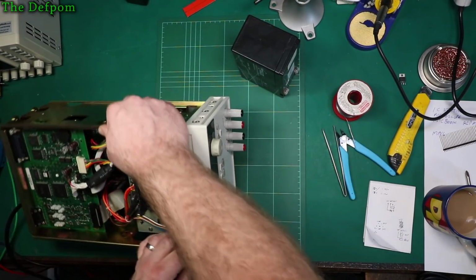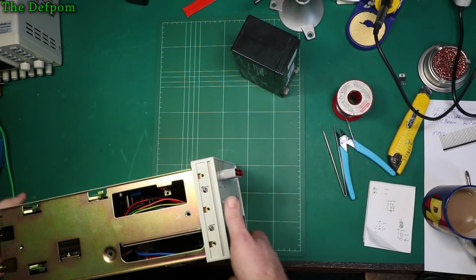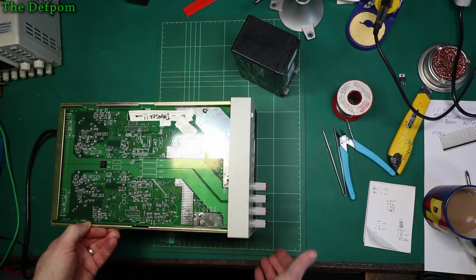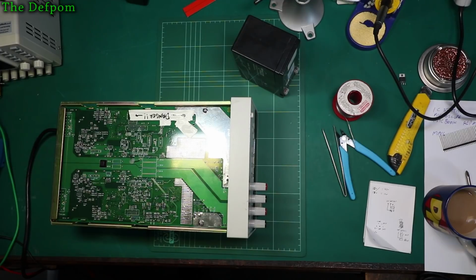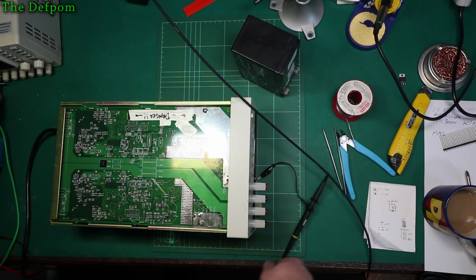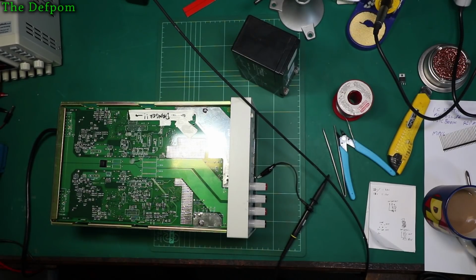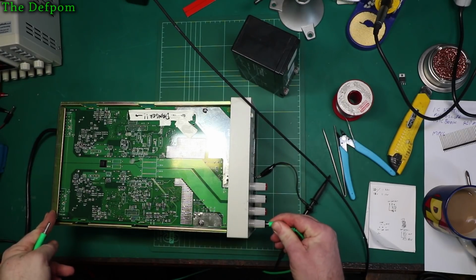Maybe that 5 volt threshold isn't suitable. Maybe it's still pulling it down, effectively being 5 volts. Then I think there's a diode in series, so it shouldn't actually matter. Let's do some more testing, see what happens. I'll have to use the scope again, let's turn it back on. And I need the ground reference, which is going to be different to before. Which reference was that one using? I think that was using the channel 2 negative as a reference for that. I can find out in a second.